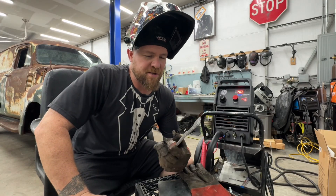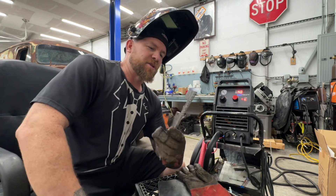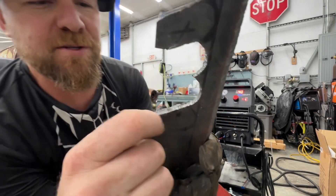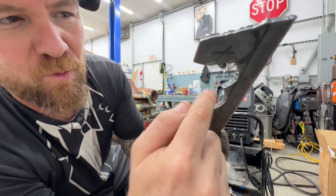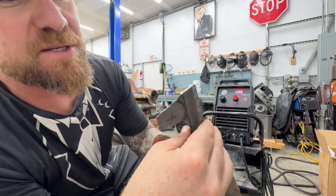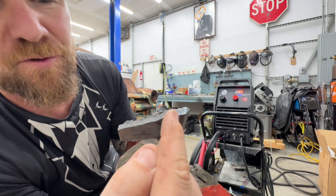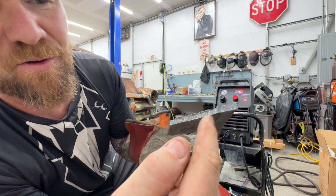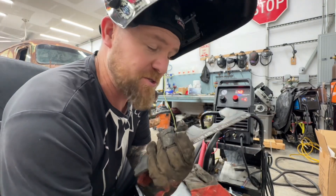To test this thing out I grabbed a piece of scrap. It's interesting because I used a different plasma cutter when I originally made some cuts on this piece — if you look closely you can see the serrations of that cut are wild, they walk all over the place. This new cut at 60 amps — if you look at the line, it's very uniform. The old plasma cutter was very sloppy; this one is very flat and even, so off to a good start.